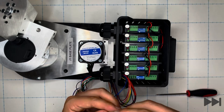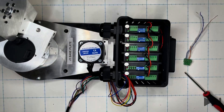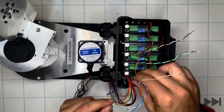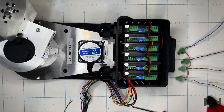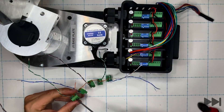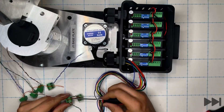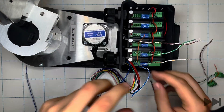The process of wiring all of the stepper motor drivers with the control wiring is quite tedious and took about 20 minutes to complete, including adding each set of three wires into the respective terminal blocks and making sure they were all correctly paired with the orange jumper wires. The wire is quite thin and if you crimp it too much when stripping it can break off. For this reason I tinned the ends of all the stripped wire before putting them into the terminal block, which helped quite a lot.